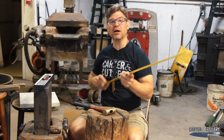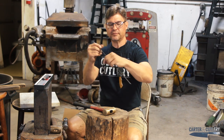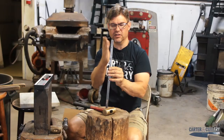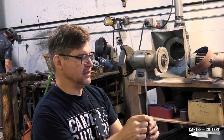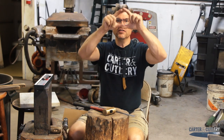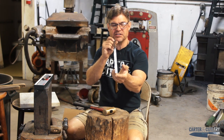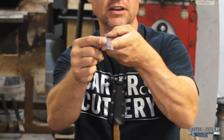Some of these things become more obvious with careful examination. This straight edge I've been using since Japan, since about 1997 or 1998, and right here at this end the whole end is kind of cocked off to one side — it's crooked. Interestingly, these Japanese straight edges have a fuller right down the middle, like an old medieval sword, so the middle is hollowed out and it's thick here, then thins toward the edges. They build their straight edges that way on purpose.